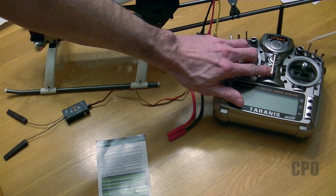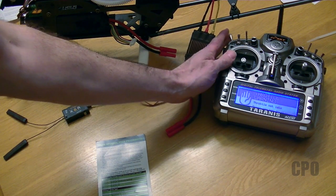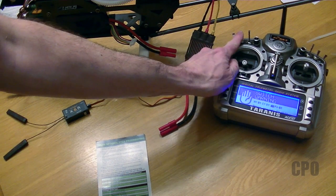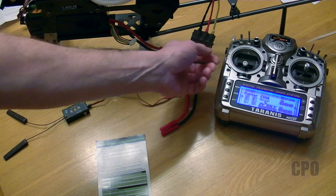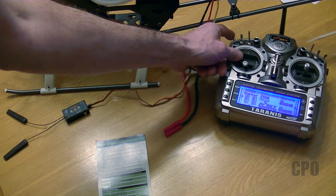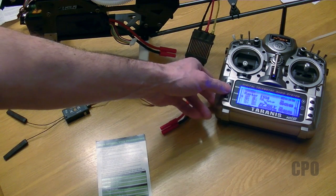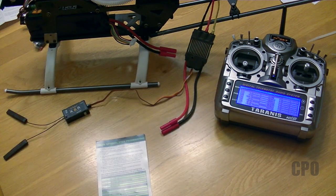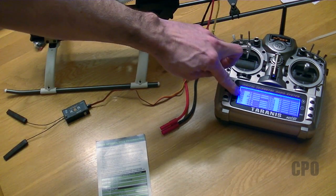The first thing we'll do is start out with throttle stick calibration. That's important to do for any ESC regardless of what the application is. In order to do that, we need to get our transmitter powered on and then set up so that you have a full range of travel for your throttle channel. In my case with the FrSky system, that's negative 100 to positive 100. Just double check that you're getting the full range out of your throttle.